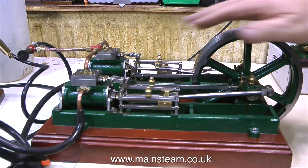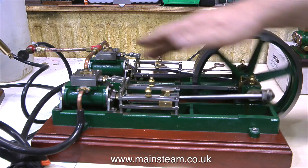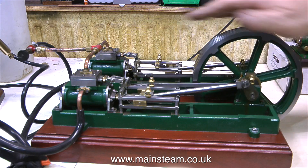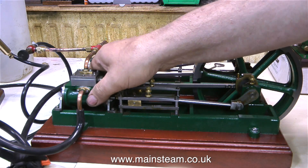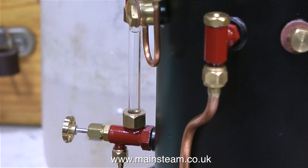While I'm waiting for the boiler to generate some steam, I'm just oiling around the engine. Then I open the small valve and rotate the engine. Any steam present — because there isn't much at the moment, not much pressure at all — but there is enough to come through the engine and warm up the cylinders. It's not that the boiler's slow at raising steam, it's actually quite a good steam raiser, but I've filled the water gauge right to the top, because the whole point of this test is to see if this boiler has enough capacity to feed the steam engine.